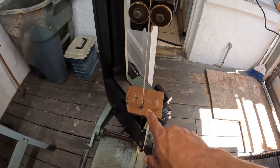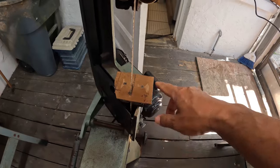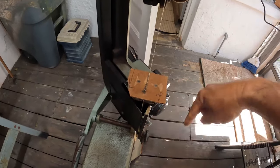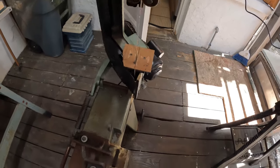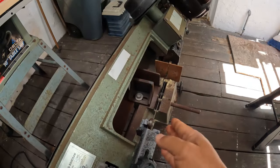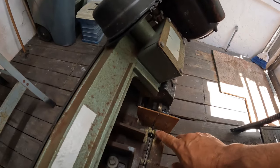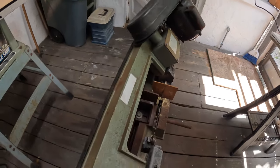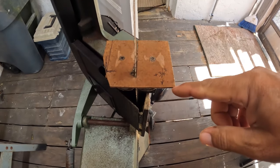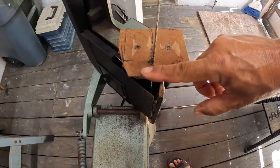So I've made a little plate, or a template at least. It actually works like it's supposed to, but I want the plate so I can keep it on, but not a big plate like the stock one, because you have to take it off each time. But I want to still be able to use the horizontal cutting and the vertical plate, leave it on there. So this clears just like it is there. So I've got my measurements all set up, so I can go 3/4 of an inch longer on this side, so it'll give me more of a platform for laying stuff on there.